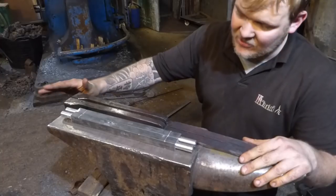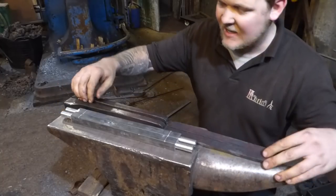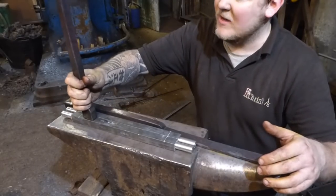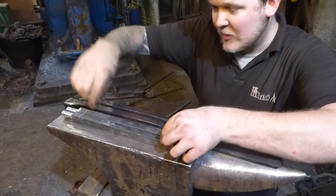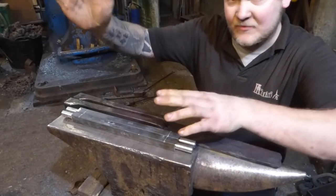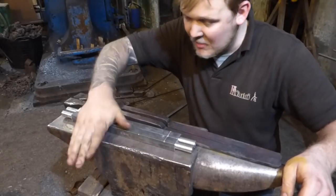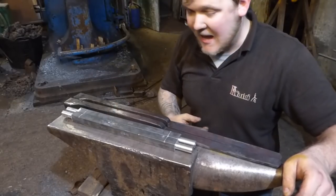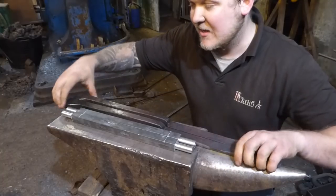And then we've got to put the tenons on this end, those tenons will go in here, part way here somewhere, and then there'll be some 20x6 strapping that's going to come up and support the weight ever so slightly, I hope. I'm going to have to make a little bit of tooling for this as well. Anyway, I'm going to get these hot, I'm going to get on, and then I'm going to show you what I'm going to do about doing these tenons on these heels here.